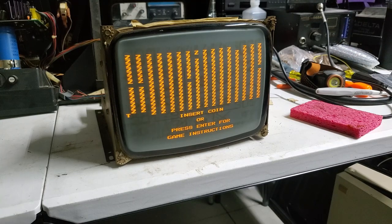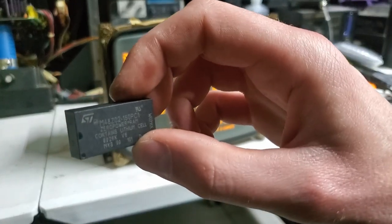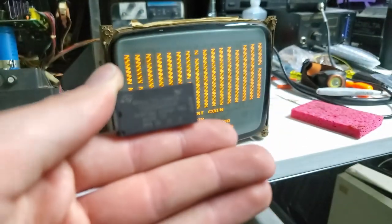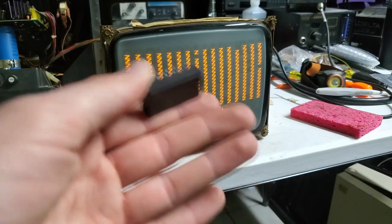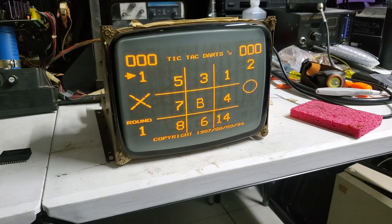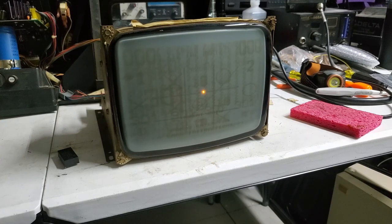So the thing with the Zs - I can't get rid of them as I stated before. But I did get this - this is a new one from Mouser. It doesn't quite look like it's anything too terribly new - it kind of looks like it was made in '99. So I'm going to stick this in here. If this is a new one, it should have like some sort of zero on it. This might be like the default state of the RAM after losing power - uninitialized. So maybe that is just bad. I'm going to try to stick this one in here. I'm guessing that this one was wiped at the factory when it was made, so it might just be empty. I'm going to put that in there and see if that will make the results any different, just out of curiosity.